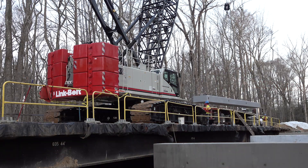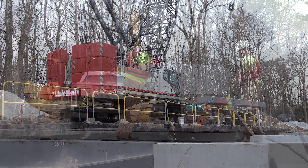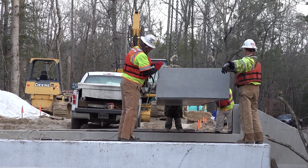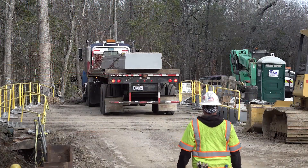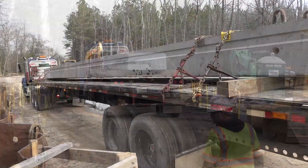The slabs — the longest are 45 feet long. The heaviest one is 48,000 pounds, and 60 feet is the furthest I go with it. The two outside ones are solid, and the four on the inside are hollow — they only weigh 36,000 pounds a piece.